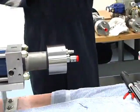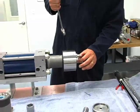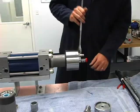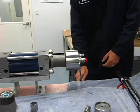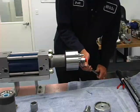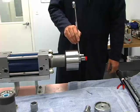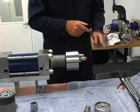With the check valve in its current position, we can't get a wrench on it from above because of the fittings in the way, and when mounted on a machine we won't be able to access it from below either. So before tightening the end cap, I'm going to rotate the check valve so we can get a wrench on it once it's on the machine. This is going to be a side mount, so this will work perfectly.